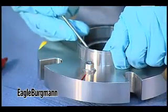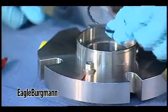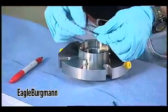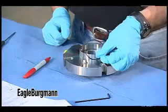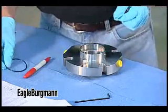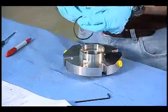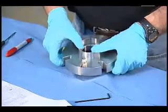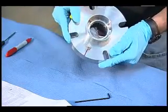I'm going to do the same thing with the o-ring — because you can't really index an o-ring very well, I'm going to pinch it at 12 o'clock as it comes out and hold that pinch point until I'm done examining it. So I can look at stretch, measure its cross section, inspect all of the surfaces, and jot down any notes relative to top dead center of that o-ring. As soon as I let go of that pinch point, that evidence is gone — this is your chance to record all that. That was o-ring number 10 — I'll go ahead and tag it. And I can keep going, because this is a dual seal — I have another seal face, another o-ring, and two sets of springs.